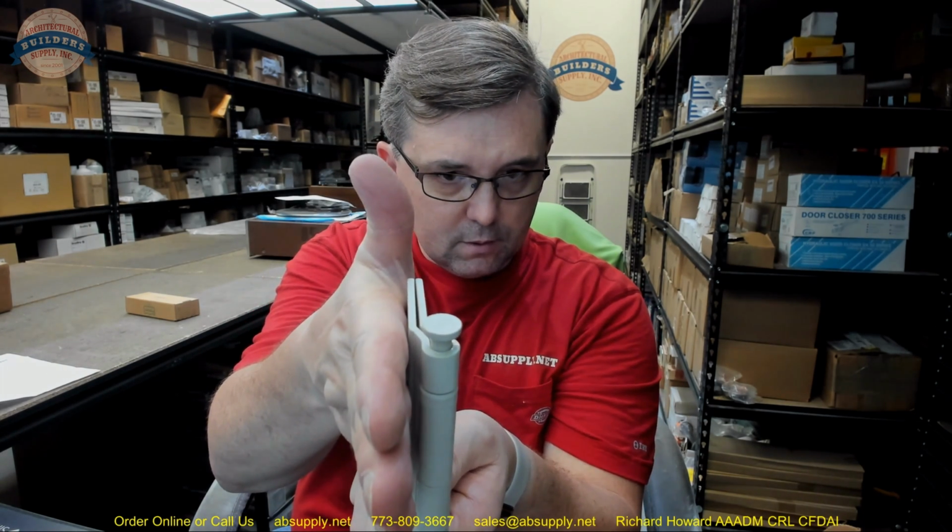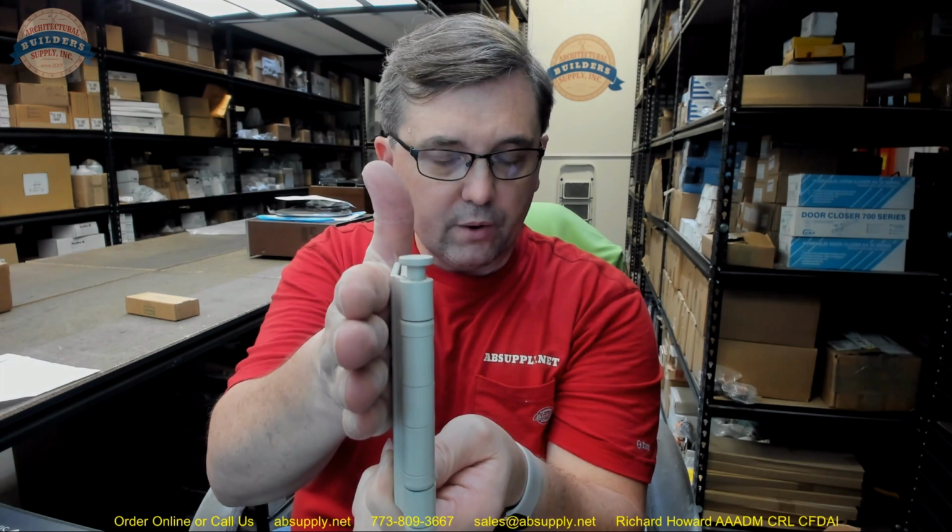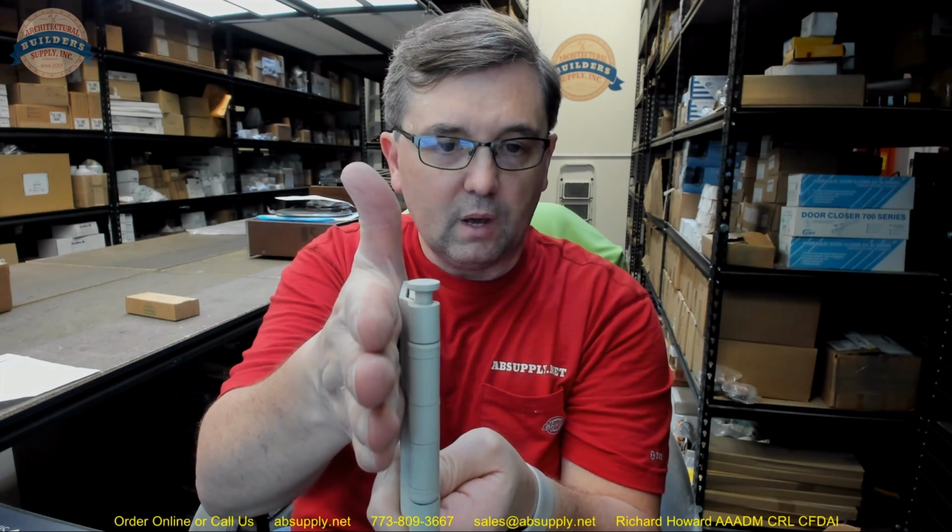but the reason that you would use a raised barrel hinge is if you were attaching your door to a frame where the door position was going to be substantially inset into the frame. If you used a standard hinge, that hinge barrel would bury itself into the rabbet or the soffit or cased portion of the frame itself, and would not allow you to get the hinge installed.